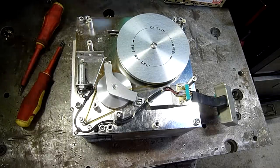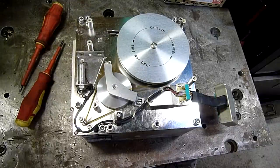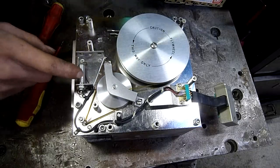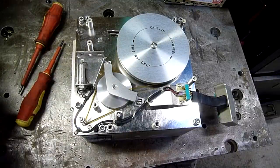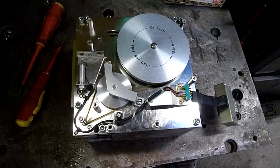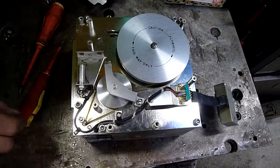Tape moves very slowly and it'll encode digitally, so you'd probably get even more than 30 minutes on it. There's a 600-volt capacitor there - it's an 0.068 microfarad cap, plus or minus 10%, 600 volts. That'll be for the motor - it'll be an AC synchronous motor, 400 hertz AC.